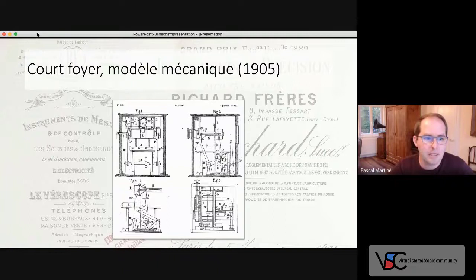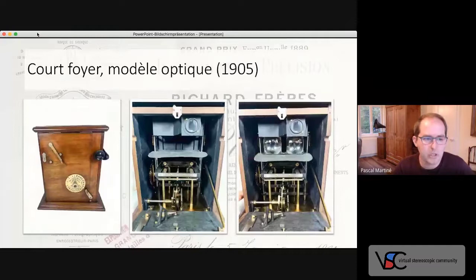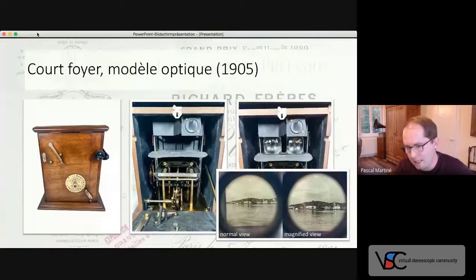The more commonly used method was the so-called Modèle Optique, which took a completely different approach to the same problem. Instead of a horizontal movement, it used additional block lenses to magnify the photo. These lenses could be either permanently lowered in front of the ocular, or manually operated by another lever on the left. Using lenses for that purpose leads to some distortion at the edges of the image, but overall the viewing experience is quite satisfying. On the other hand, the stereo photo was cropped — not much, but sometimes you are going to miss details in the corners.